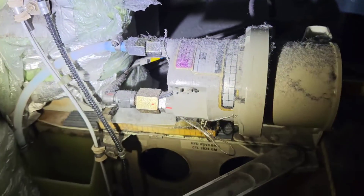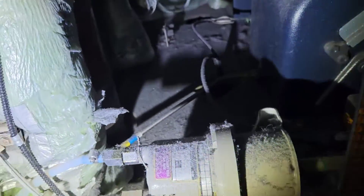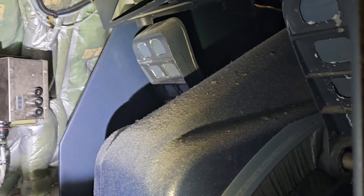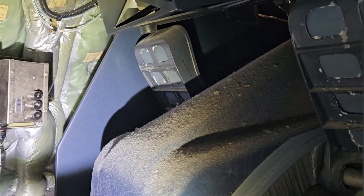What do we need for a hydraulic system? First thing is a place where we can store the fluid. For that we have here the brake control hydraulic reservoir. You can find it behind the first officer pedals. Then we need a power source, and in this case it will be the pilot by pressing pedals, and from there power will be transferred to the brake control master cylinder.